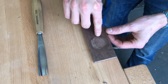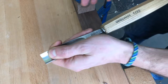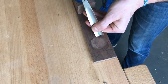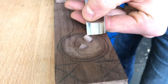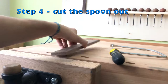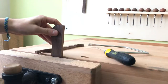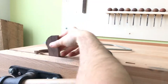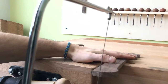To make a perfect cut along the inside line I simply re-grip the gouge — my left hand holds it like this now and my right hand is again at the end of the handle. This gives me more control and I can get into bigger details. In the fourth step I cut out the shape of the spoon with the coping saw. I simply put it in my vise and cut it. You can also use your F clamp — clamp it down and cut it with the coping saw.